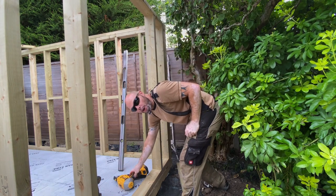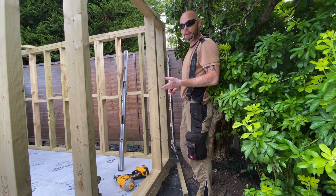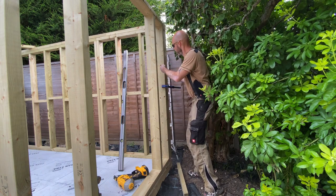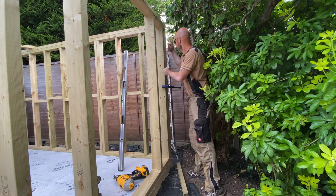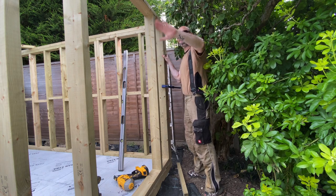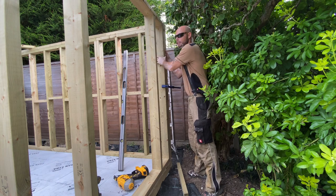And what I'll also do is, I've got some 250, 200 and 100 tech screws. I use the 100 tech screws and I'll put one through that way and one through that way every so often, just to pin this front wall in to this wall, both sides, just because it is the load bearing one, it's got the steel on and everything else. So I just want to make sure these are definitely happy, connected, ain't gonna go nowhere.